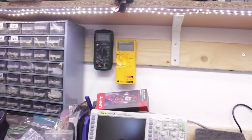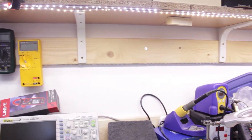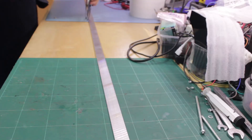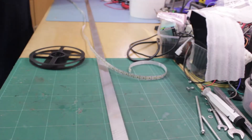So I decided to finally fix this problem by installing a new strip of LED lighting. I am using this 25mm wide, 2mm thick piece of aluminum strip as the backing. This will act as both a heat sink and a surface for the LEDs to stick to.